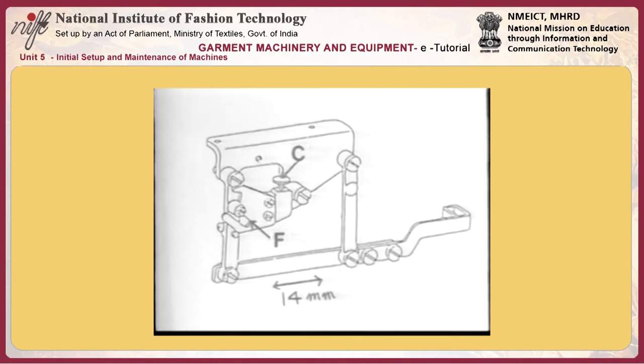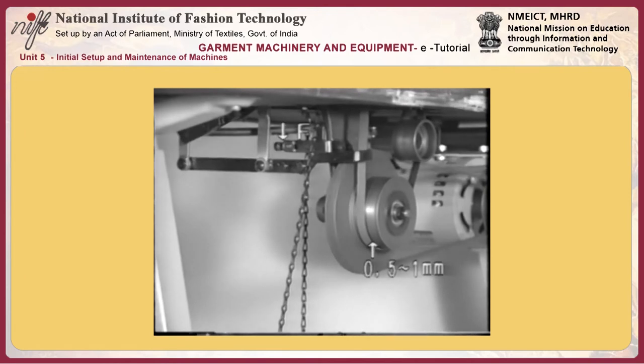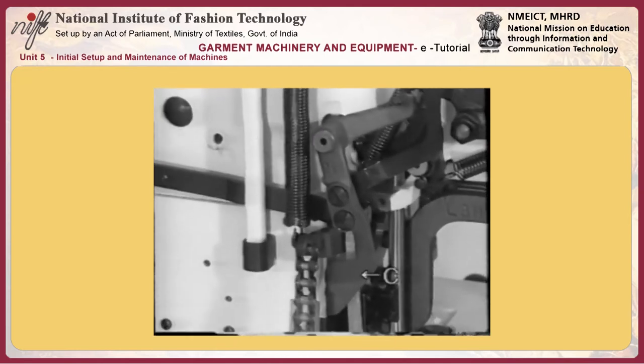If you turn the handle with the machine head tilted, the handle may be locked. In this case, knife bar driving crank D is engaged with the knife bar driving lever bell crank. To unlock the handle, disengage the knife bar driving crank by hand from the knife bar driving lever bell crank.